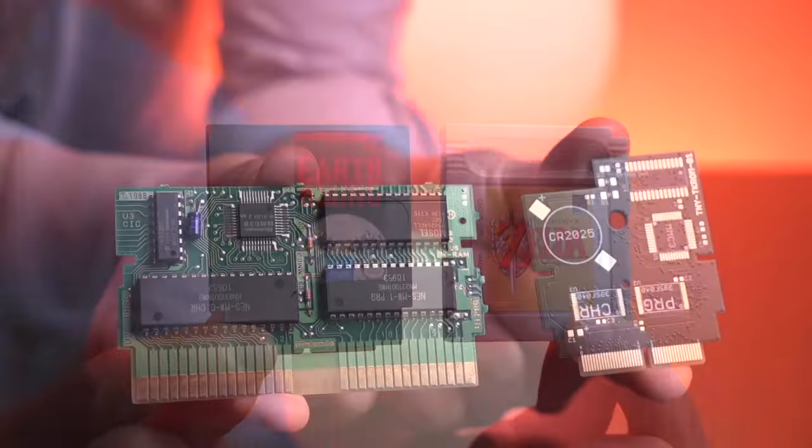Next, we're going to want to place the reset button into its opening prior to installing the power management board behind it. And once it's in, we can slide in the power board as shown. Be sure to install it under the two LED light pipes. Give the power and reset button a quick test to ensure that they're able to actuate properly. Now, this is optional, but I placed a piece of thick card between the two LED light pipes to reduce any light bleed between the two.